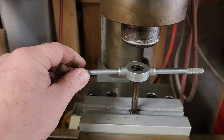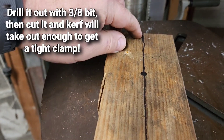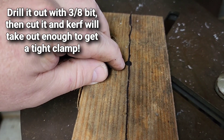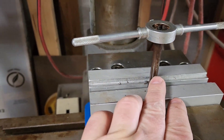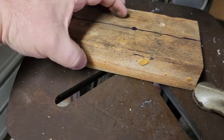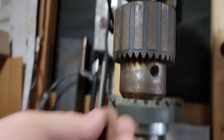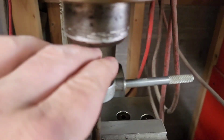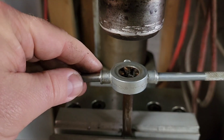I did a search and came up with a YouTube video of a guy that used his drill press. Basically what you would do is cut this in half and drill out for whatever diameter — so for 3/8ths you'd be slightly below that — so you could clamp it in and get it straight, and then clamp this and use the head of that right here to actually push on top and keep it straight and keep a little pressure on it.